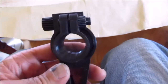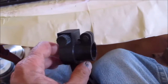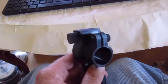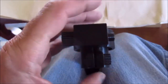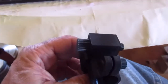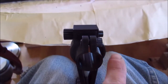The part, or the macro adjust, this is one of them. This would be where you put lasers, they have lasers that are like in tubes, and they're yay long, and it's 1 inch diameter. So I made this so I could pinch here, tighten this up, and diminish the diameter, or provide clamping force for whatever's in there. And this, I made it like a worm gear. If I twist this drive 62 times, the collar will revolve once.